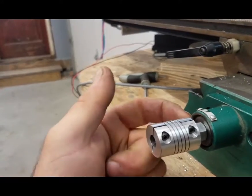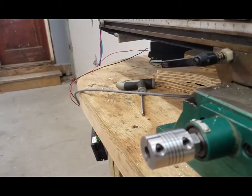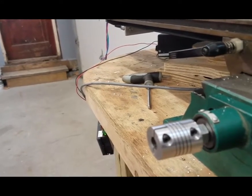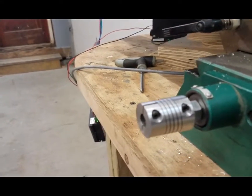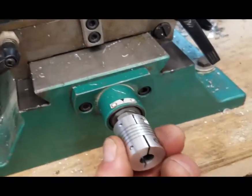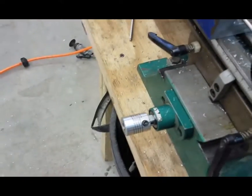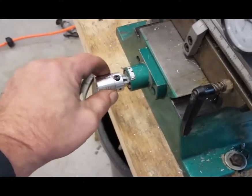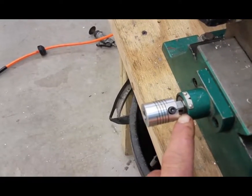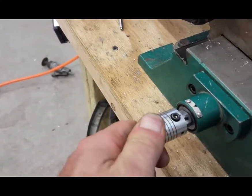With this one it was an issue. I ended up threading the lead screw shaft and putting a nut to lock the thrust bearings and tighten up on them to take up the slack so they're just snug. I also ended up threading this coupler — which I wasn't planning to — and put in a set screw and threaded an M4 down into the keyway, so this thing is locked right into the keyway and our thrust bearings are tight and snug, just the way they should be.